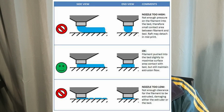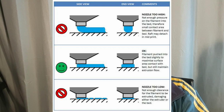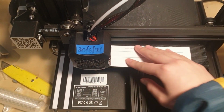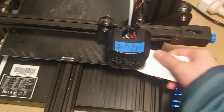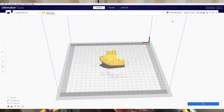Make sure that your bed is level. Too low of a bed can cause your print to not stick to the bed properly, and too high can give you the elephant's foot. In the worst case scenario, the nozzle can scratch the bed. Leveling the bed is one of the most fundamental skills for 3D printing, and if you don't know how to do it, then there are some links in the description that will tell you how.